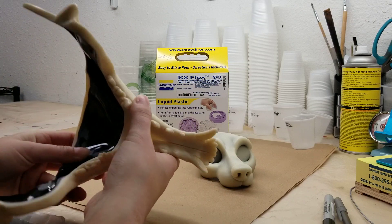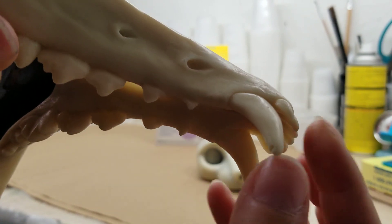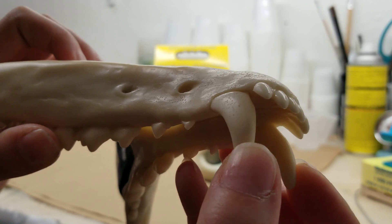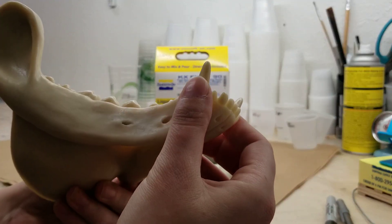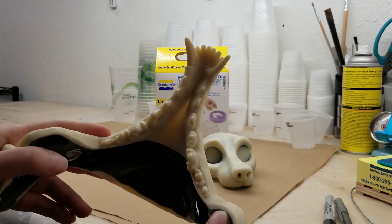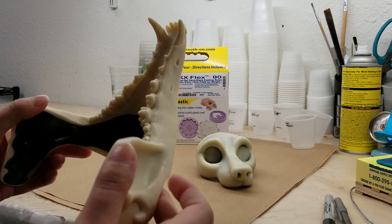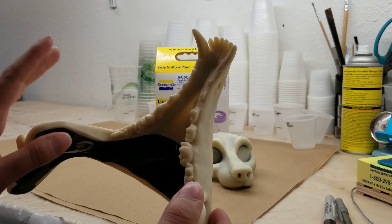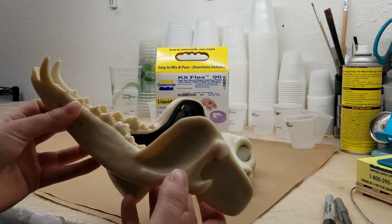Way faster than any of our smooth cast series materials. So even in small amounts — and I don't know if you can see this — but there is a bubble right here on the tooth and a couple little tiny micro bubbles here. I did my best to get out the bubbles as fast as I could, but the working time is very, very limited on this product. We get a full cast done within half the time of our normal skulls, but it takes a lot longer for the material to fully set — about an hour. So it has to sit in the mold for an extended period of time before we can pull it, so it kind of ends up evening out time-wise.